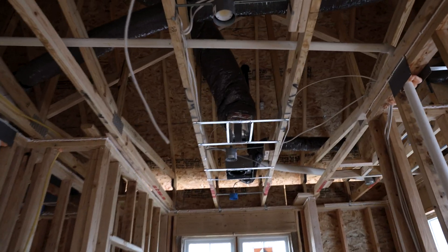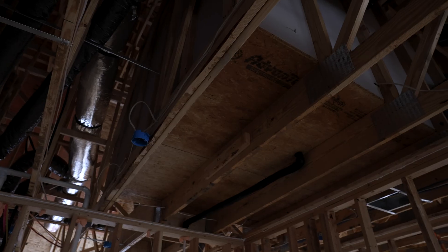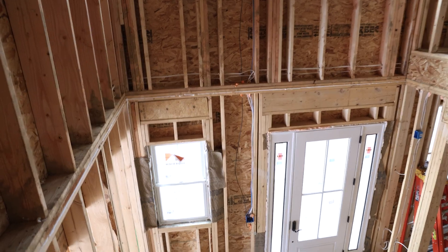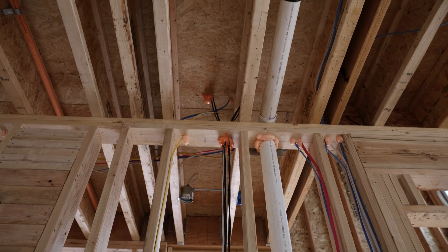After a long day we're pretty much finished. We just have to run a couple last jumpers. In the master bathroom and master bedroom we're just working on wiring that jumper. Master closet - there's the jumper, there's our two wires. We stapled them in an infinity symbol so they hook onto each other but they also mount so they're not hanging for the drywall guys. This black wire here is for a touch pad. We ran another wire to the TV for control or ethernet depending on what TV we go with. Moving down, there's our doorbell line - that black line. We made sure to fire foam it. We fire foamed both of those holes.